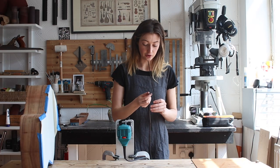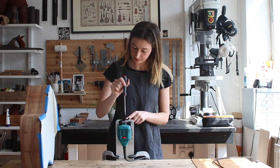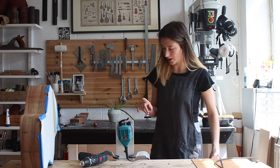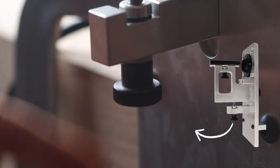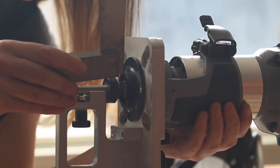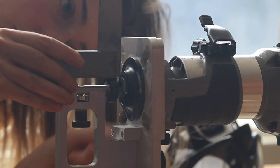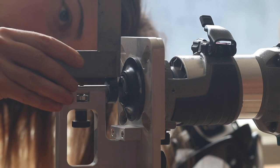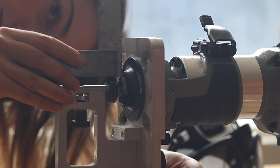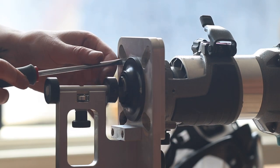But in order to do that, we need to make sure the zero point is completely correct. If you have already screwed your router to the actual base, grab your screwdriver and just loosen up those screws. To set the calibration, first wind up this bottom knob so the zero bar can be set properly — wind it all the way so the zero bar is being touched. You'll then want to adjust your cutter manually to the highest point it's going to go. Pop your square on those roller bearing guides and check that everything is flush with the top of the square. You might have to make some little adjustments by moving your router around, but when that's done you can lock off the router base and tighten up your screws nicely.